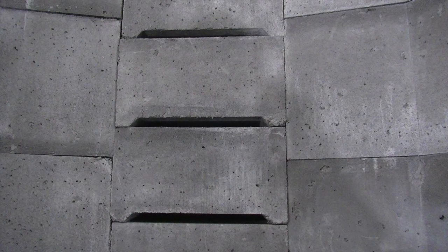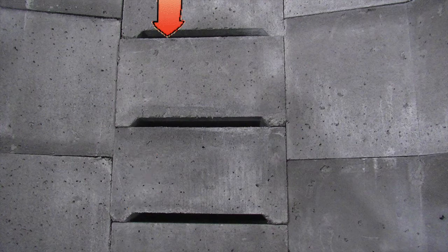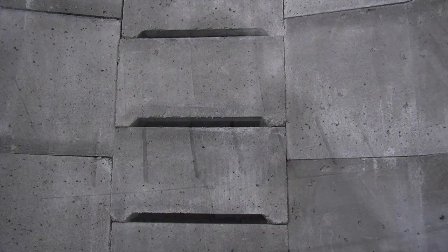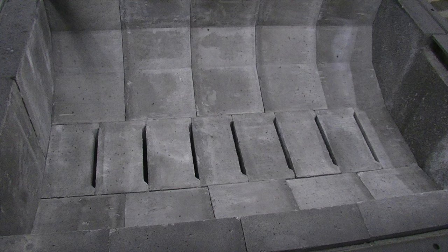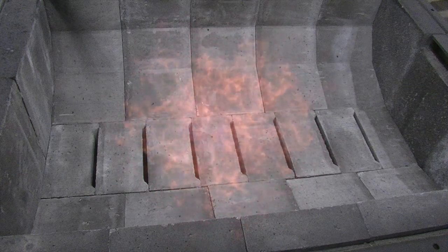The refractory grate system on the bottom of the fire chamber is made up of 8 four-and-a-half-inch bricks that are 4 inches thick and designed with a half-inch gap that allows ash to drop down onto the ash pan below. This same gap also allows air to be blown underneath the fire, which adds more heat to the refractory cement. It is also because of this high heat that the complete burn of most smoke in the fire chamber is possible.